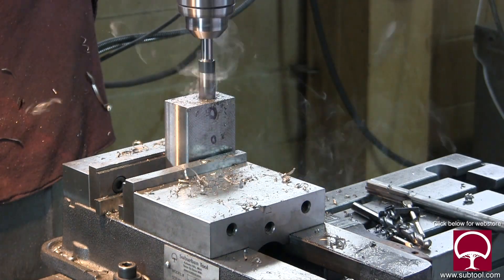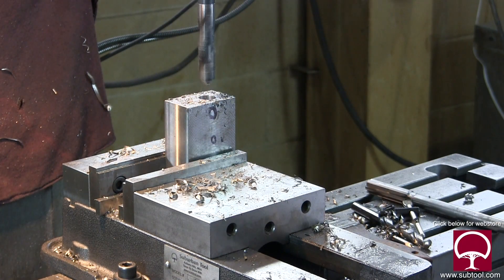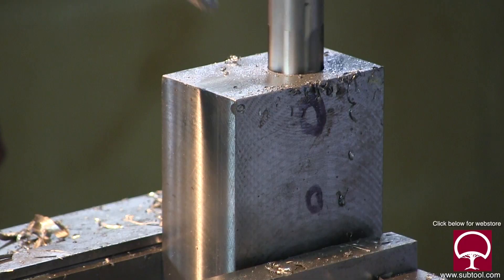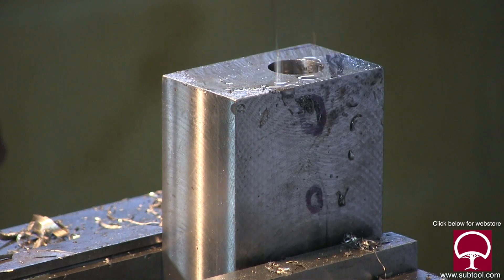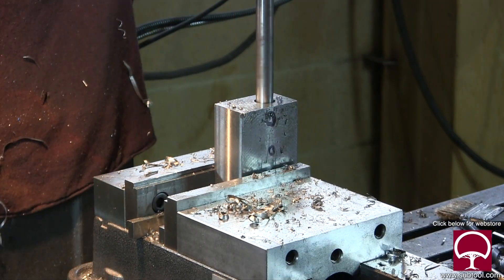I think this was three-quarter inch, and we're going to put in another collet. You can see Glenn in the background there as we're reaming this. I like to pull the chips out periodically — I think you get a straighter hole that way, since the chips you're dragging out tend to make the first part of the hole a lot bigger.